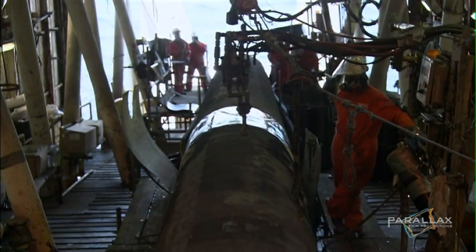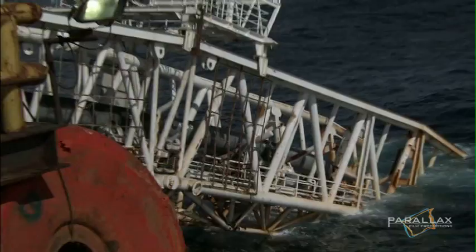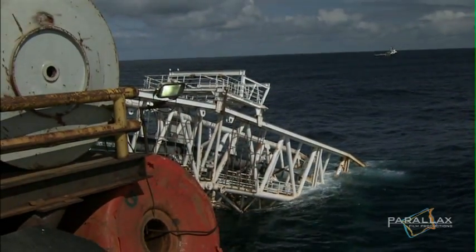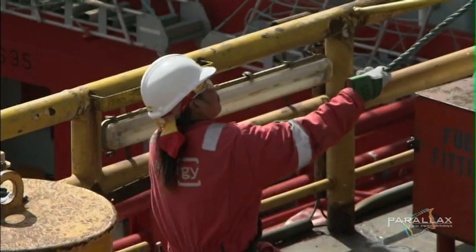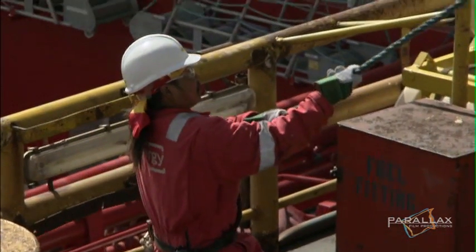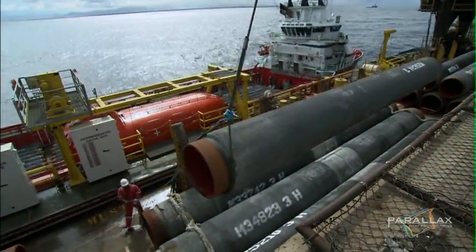The pipeline is built as a continuous tube that is dropped from the ship to the seabed. If the ship halts for too long, the strain on the pipe could snap. The barge moves along at 4 kilometers a day and needs a constant supply of pipe sections, which must be delivered in the order in which they are to be connected and laid down.